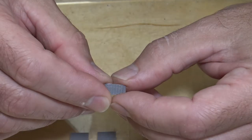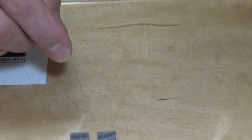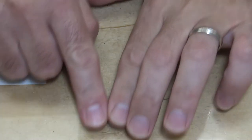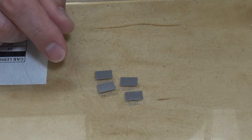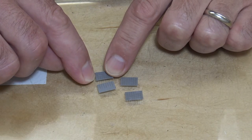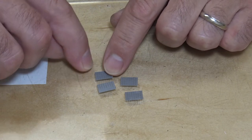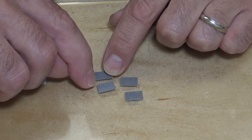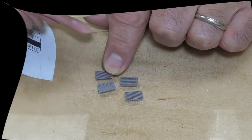Actually, the first thing I think I'll do is trim the thickness down. So I'll trim the thickness down on the mill, exactly the way that I did this, so I don't need to show it again. Then I'm going to hang this piece over the edge of the mill with it lined up, and I can use the mill to trim those off, halfway along that rib.